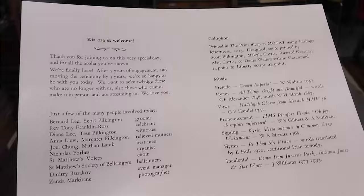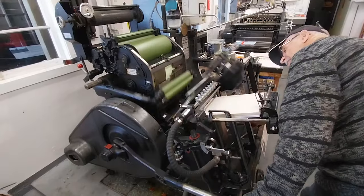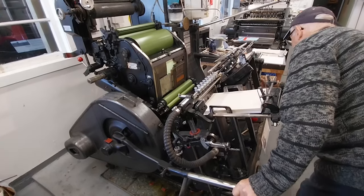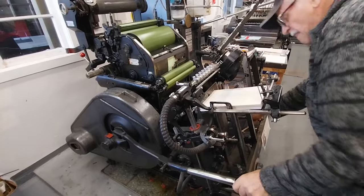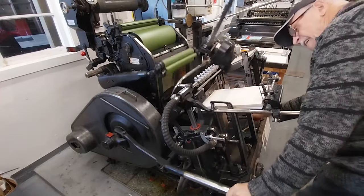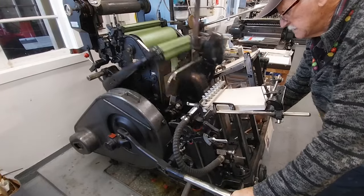We also had to do this for every color that we used, and to make sure that all of the colors were balanced right on the page and that everything was spaced correctly, because each color is a separate pass through the press. The front page had 3 colors, so that means it had to go through the press 3 times.